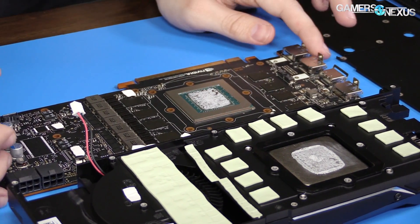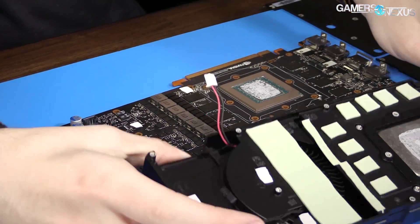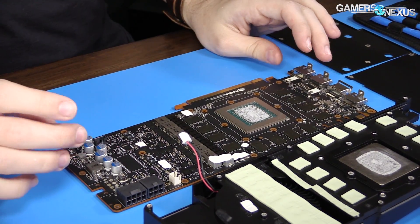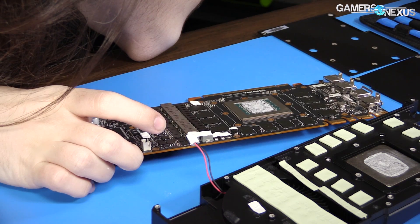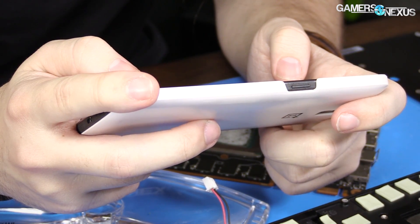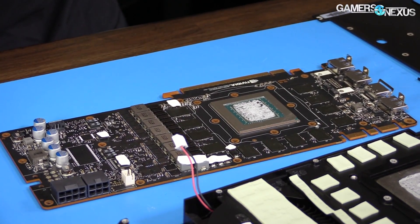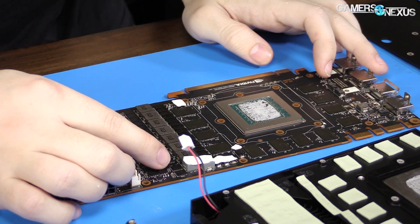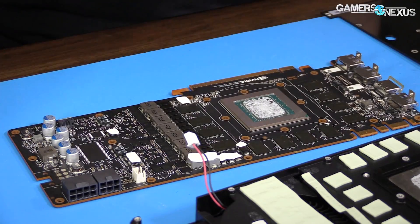In terms of everything else: here is your fan header, and here is the power connector for the LED — that powers the GeForce GTX LED. For the FETs, we still have Fairchild FETs. Some of these parts are a bit different than on the 1080 Ti Founders Edition PCB and we'll look into having the board analyzed separately. One part that is definitely the same: the E6930 FETs for the memory VRM at the top of the board — you can see our 1080 Ti Founders Edition PCB analysis to learn more about those.